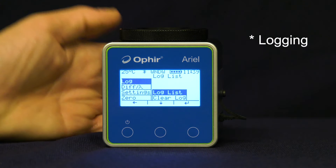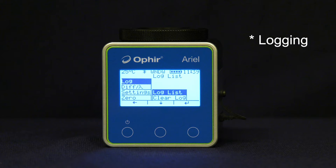Additional menu items: Logging. The device logs measurements automatically — in CW power mode, it logs once each second, and in short exposure mode, it logs every pulse. The internal memory can store a great deal of data, as it's designed to be fully usable standalone. When the log reaches maximum, the oldest measurements will be overwritten. The logging submenu lets you check memory status and clear the entire log.